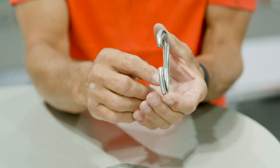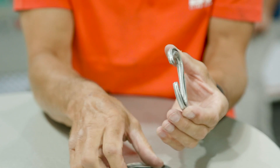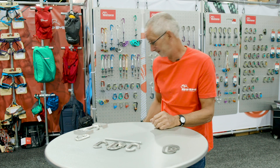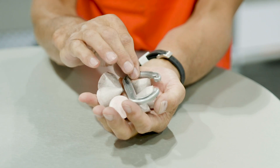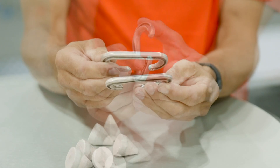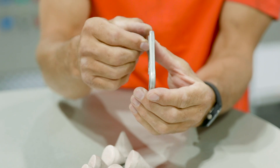The next process is to remove that excess flash on a clipping press, where the carabiner gets punched through and the flash is blown away, leaving the profile of the carabiner as we want it. This does leave a flash mark that needs smoothing, so the carabiner goes into a large tumbler full of ceramic chips. After about 15 to 20 hours of tumbling, all sharp edges are smoothed over, the flash line is removed, and all the inside radii are really smooth.